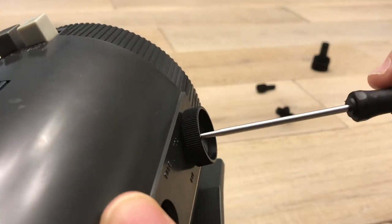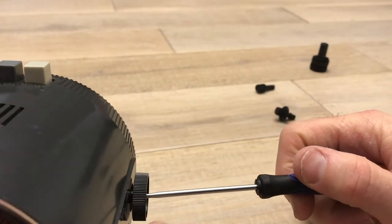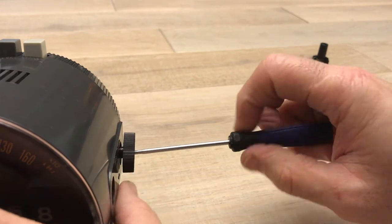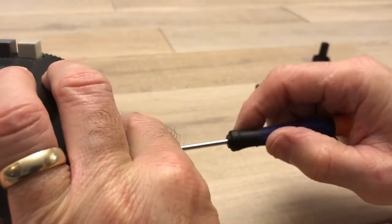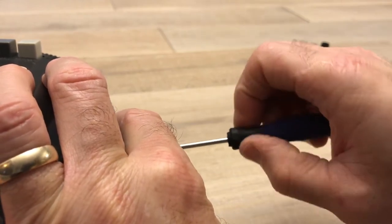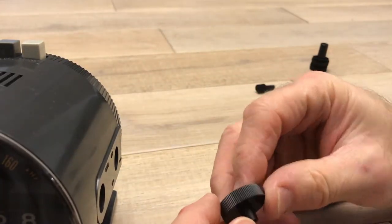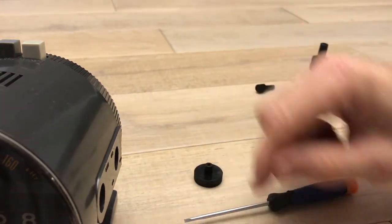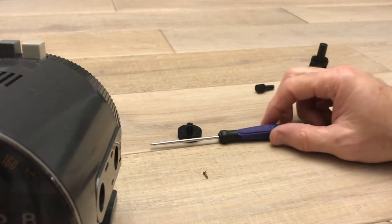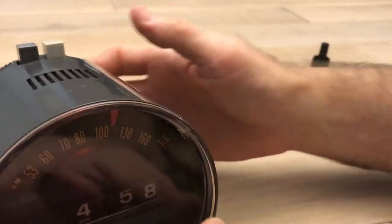The screw that goes in here is a steel screw going into a brass fitting. I personally believe what's happened is people have over-tightened those, and I can tell you from experience — I do have another clock used for parts — you can strip out the brass threads inside the clock. Some of the biggest problems people have is trying to torque down these screws. There's simply no reason for many of these screws to be torqued down, but you can't control what was done in the past.